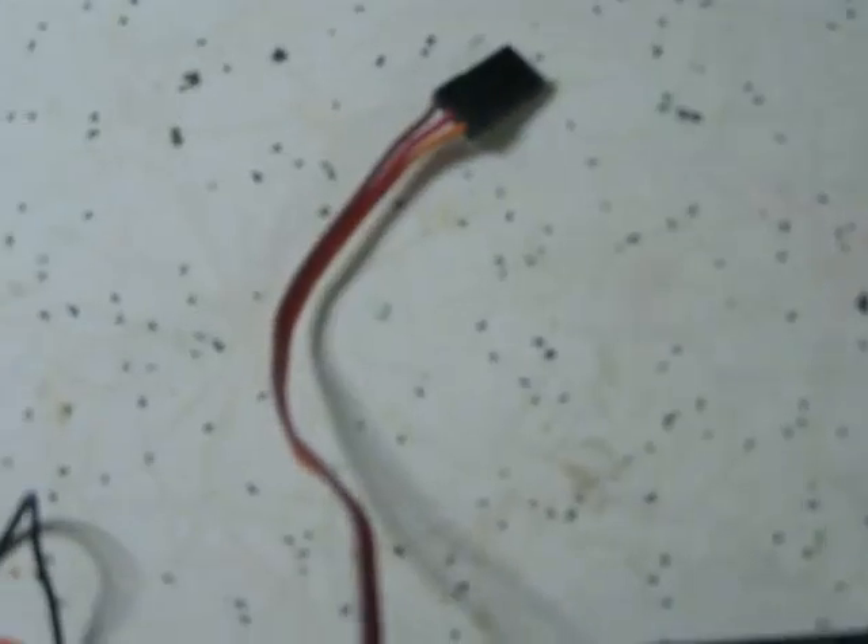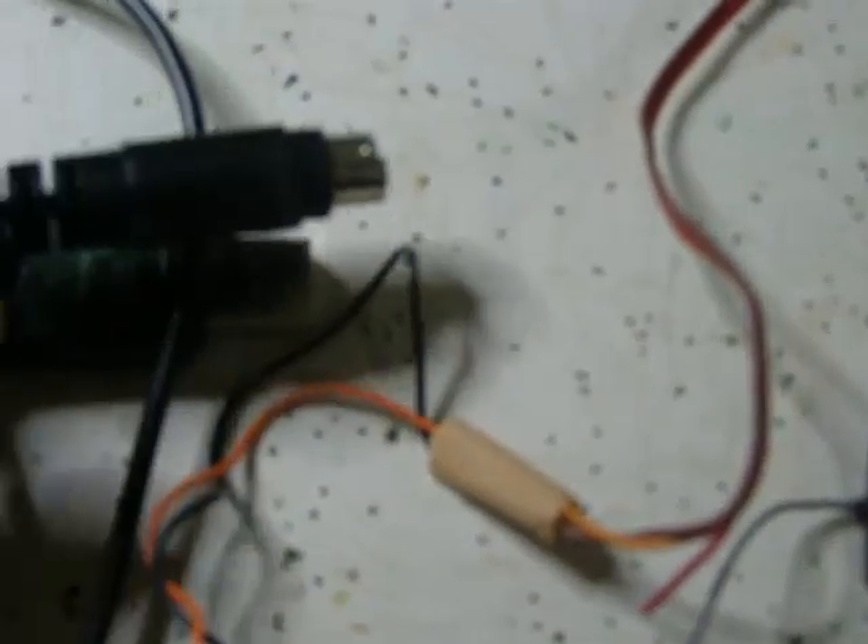I have an old little connector from another remote, so I just plugged that in and got the wires. You'll need the end of a servo lead. You'll want to put ground to brown, or whichever wire you'll remember as ground, and the PPM input to — in some cases it will be white or whatever — but just on the absolute opposite end to ground. You can just cut this off a servo and cut the end off this, and hook the wires up directly.